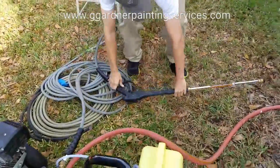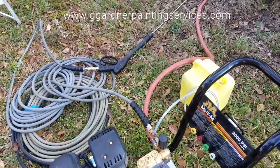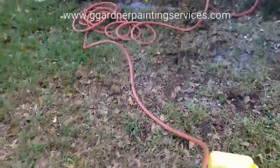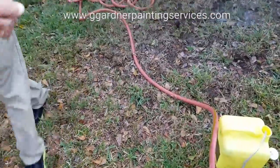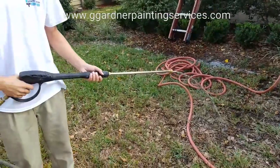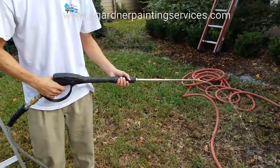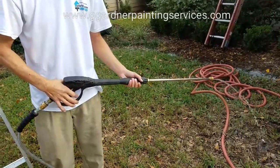Next, we're going to turn the water on. We've already confirmed the water is operational, and David's going to turn that on. I'm going to grab the gun and take the tip out — which connects the same way as the water line — and David's just going to pull that trigger to purge out any air bubbles or debris. Depending on how long or how often you use your equipment, you might get bugs and insects in the lines, so we want to make sure and blow all that out. Looks good, no air coming out.